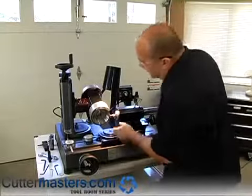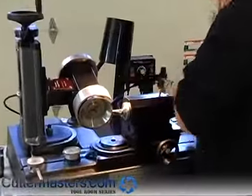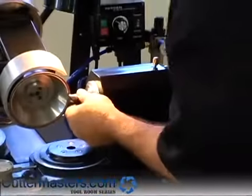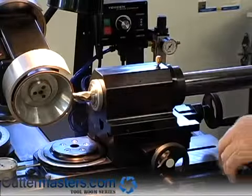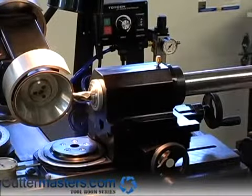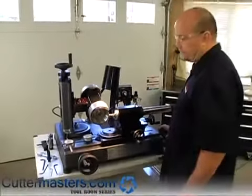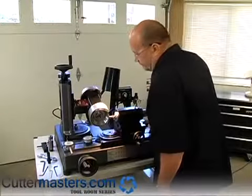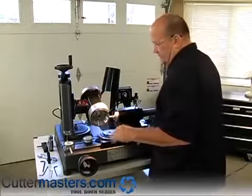Now all you have to do is locate the tool to the wheel. Very straightforward. The wheel is set, you set your indexing collar to four flutes because we're grinding a four flute. You snug up the tool. You never touch this feed unless you're positioning for some reason. Everything is done with the upper carriage feeds from this point on. This is 30 thou off — you don't touch that.